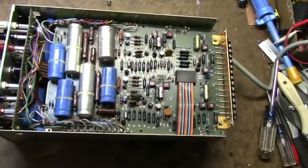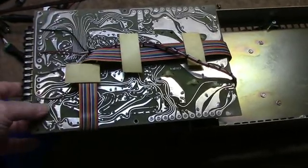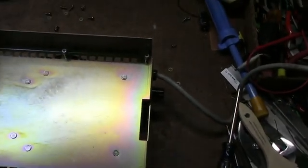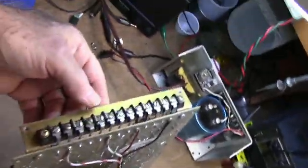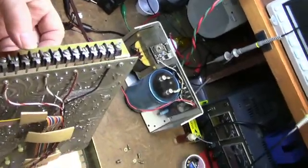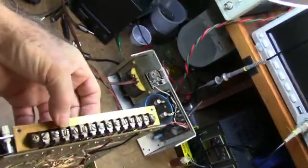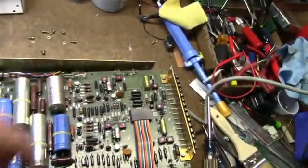It's fairly easy to get to the innards of this thing. I removed six screws on the board and the thing flips over. Here's a view of the bottom of the board — a ribbon cable runs across. This sure looks like 1970 to me. Fairly clean, there's really not any corrosion under here either. They have some type of cadmium plating on the metal here. On the back is a terminal strip where you can set it up for remote sensing, etc. Looks like they've got it jumpered already. I'll assume the jumpers are all right — we'll know when it's powered up.